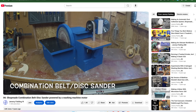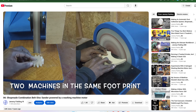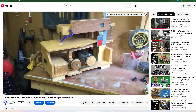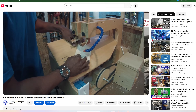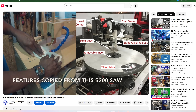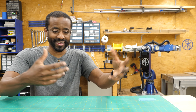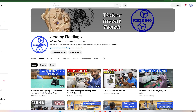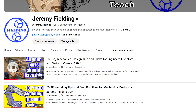The moral of the story: the shape and orientation of your part relative to where the load is applied matters just as much as the material you're using. If your primary load were horizontal instead of vertical, you'd orient the material accordingly to maximize its use in line with the load. Looking back through some of my older videos, I've built quite a few power tools using wood as structural material and those machines worked just fine — stiff enough and adequate to get the job done. There are two additional videos I'd point you to for more information on designing the actual thing itself, links in the description. But there's one more concept so crucial it's worth bringing up here.